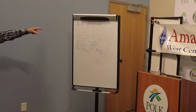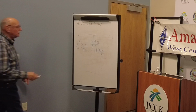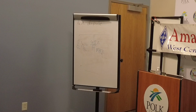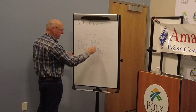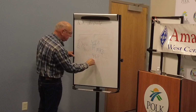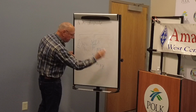But that's a wire, and it's not free space. What's the propagation of the wave on that wire? Is it at the speed of light? No, it's something slower, somewhere around 95% about. So in actuality, it's about 468 or 469? 468 divided by the frequency in megahertz. You still may.